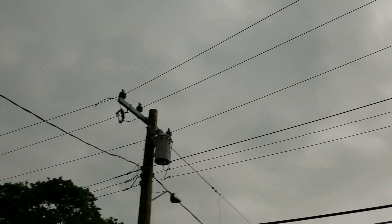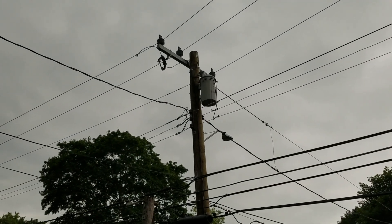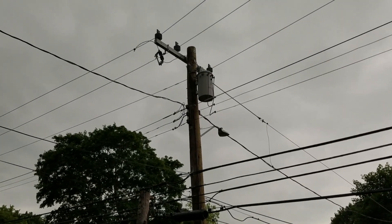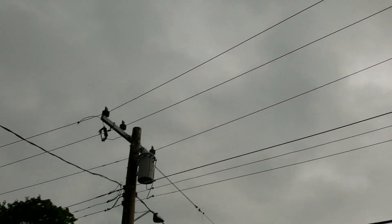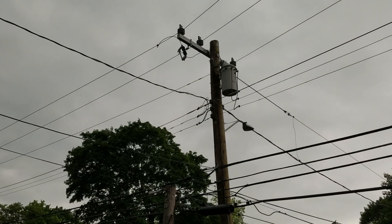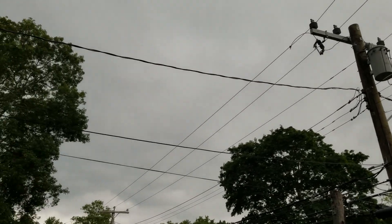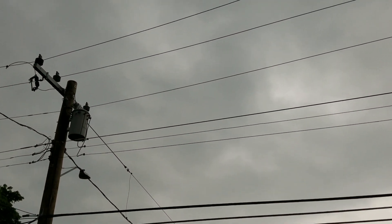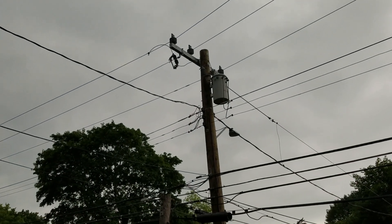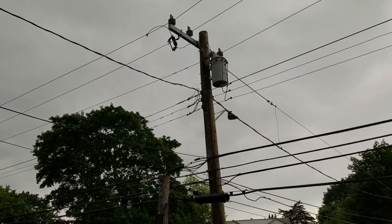If the world comes apart and we lose power from the utilities — and I'm not even going to get into what's upstream from here, because there are transfer stations, distribution stations, and main generators whether it be a reactor or turbine — but something is going to make three phase, distributed via transmission lines through a series of transfer or distribution networks. At your house, if you lose power, it's a result of either the high-voltage lines being cut down because of a car accident or an interruption at one of the distribution stations.